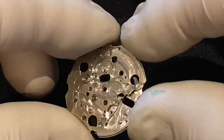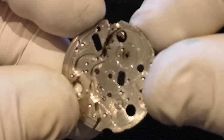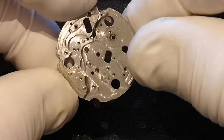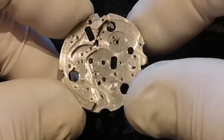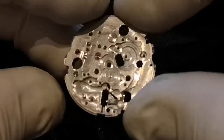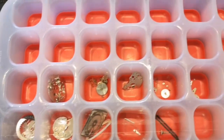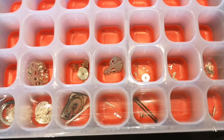This little odd lever probably will come out, but to be honest, it's not coming out willingly. Experience of other things — if it doesn't want to come out, it doesn't need to. Just leave it be. So there we go — that is the Seiko 5 6119C completely stripped down, and nice and safe in the ice cube tray, plus the balance.